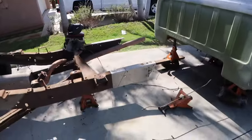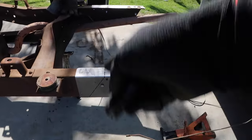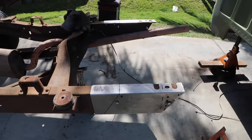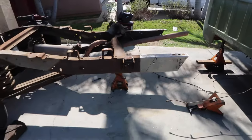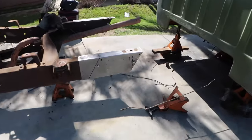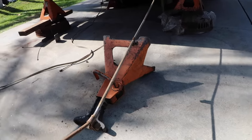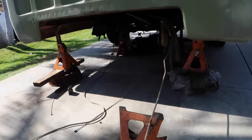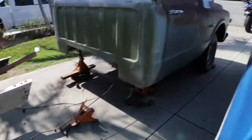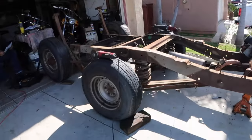We pretty much topped it now, we just got to get the 12 from underneath. Once we slice the 12, you can slide it back in with the C-channels and everything should line up pretty good — you tighten it, you weld it, and then you work on the rest. As you guys can see underneath, you will need a few jack stands just for your own protection and for stabilizing the cab, because they don't want to go forward.